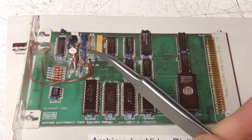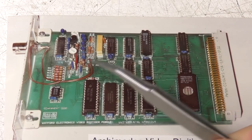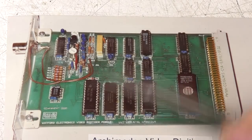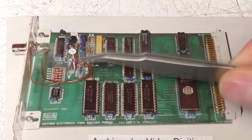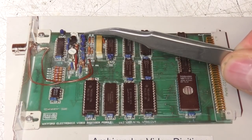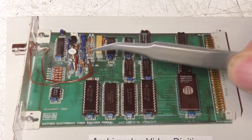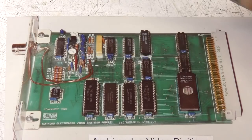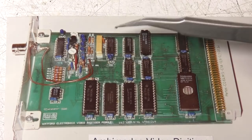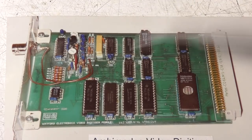And there's also an auto gain adjustment circuit, and what this did, this actually used an AND gate on the parallel output to produce a signal when all the output bits were 1. Then you would use that to increase the upper reference voltage of the A to D. So the A to D's reference voltage was between the black level of the analog signal and the peak of the video. So regardless of scene content, it will try to adjust itself so that the full range of the A to D digitized that scene,